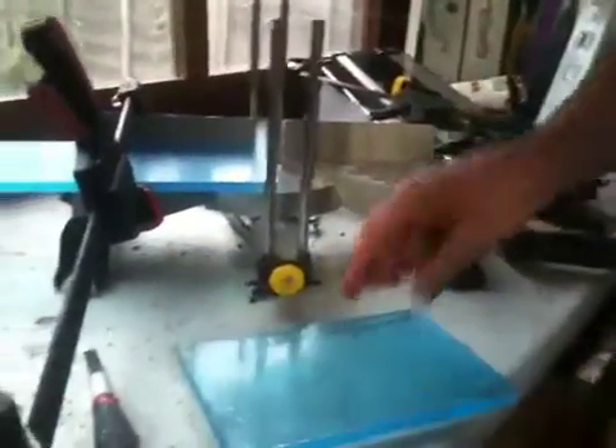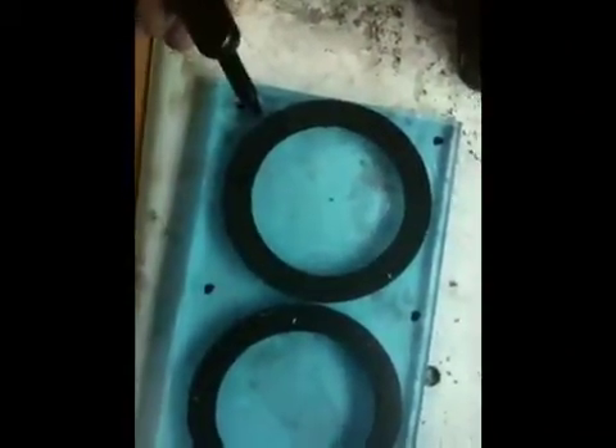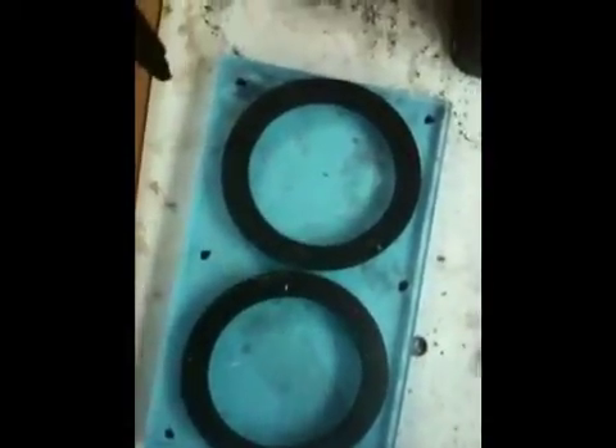Now to cut piece number two. I've cut my two pieces of plexiglass and I've now marked the holes where my bolts will go through. There are going to be six altogether — one in each corner and one in the middle on each side. I've taken the blue protective layer off. You can see the four holes in my plexiglass. I've made two arrow marks so that's where the pieces have to match up, because doing homemade stuff you never get holes in exactly the same place on two pieces. That way I know which way round to assemble them, otherwise you'd end up with a wonky contraption.